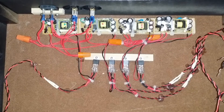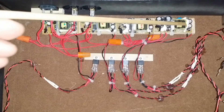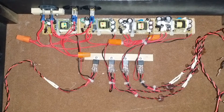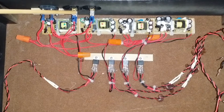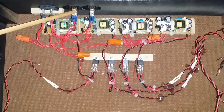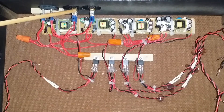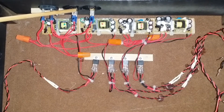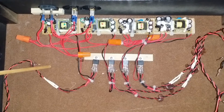So this is the power setup for the Apollo Command console. Basically these are four 9-volt power supplies — I had some that I used for Arduino projects and paid about a dollar and a half for each. I basically gutted them and rewired them to connect to a 110-volt power source. I set those up on two switches. Originally I had planned to have the command console run each half separately, so I went the two-switch route, and those then power on and off each pair of the 9-volt power adapters.